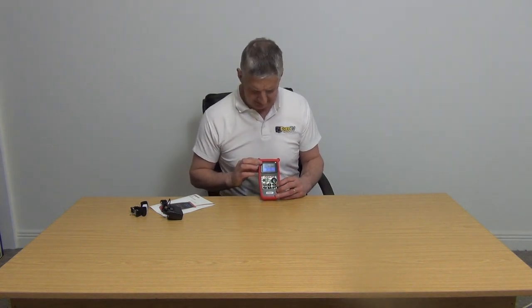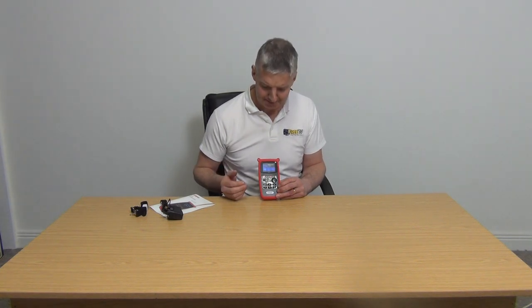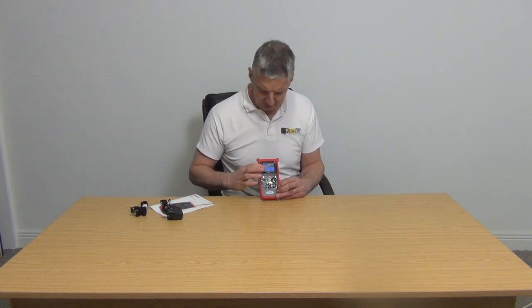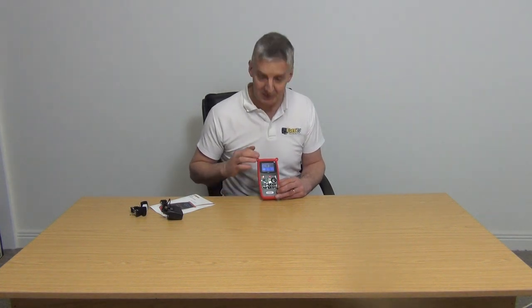The next setting shows what satellite we're aiming for, and the next two things let you enter your longitude and latitude. What I did was go on to Google on my phone and get my coordinates. It gave me minus 7 degrees longitude and 52 degrees latitude north of the equator. I just arrowed down and was able to press OK and change the settings using the up and down arrows.